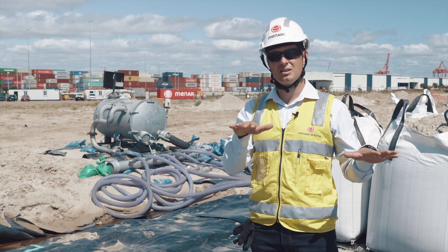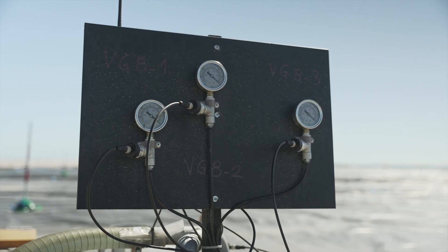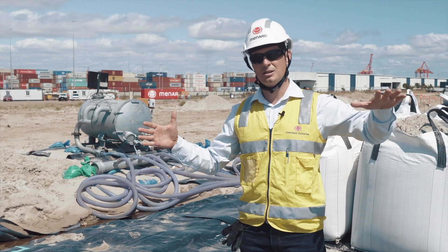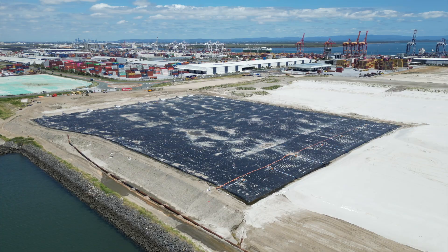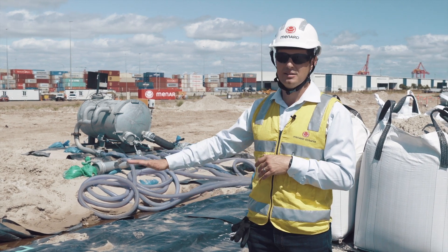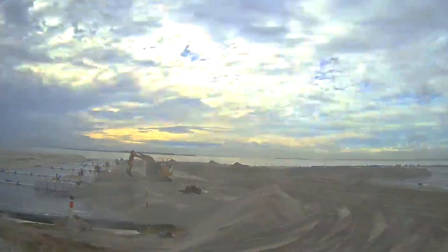All the PVDs are connected at the top so that when we turn the pumps on — which you can see here — the vacuum pressure is sucked from the soil matrix, and the black membrane compresses onto the soil. The walls and everything works as a complete system. The phase we don't see today is actually a capping layer of sand, and that layer of sand will be pushed out just to create a small confining pressure for the vacuum membrane.